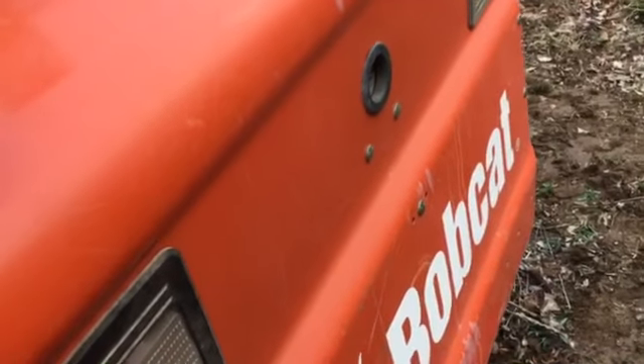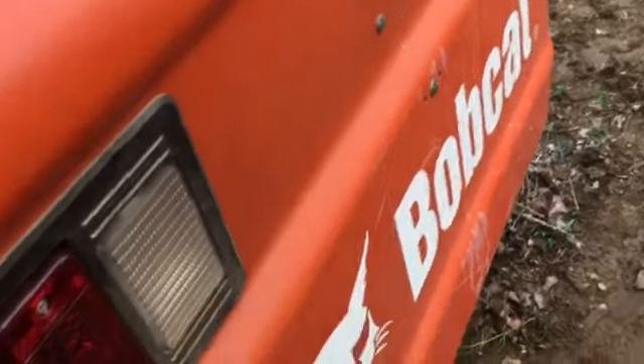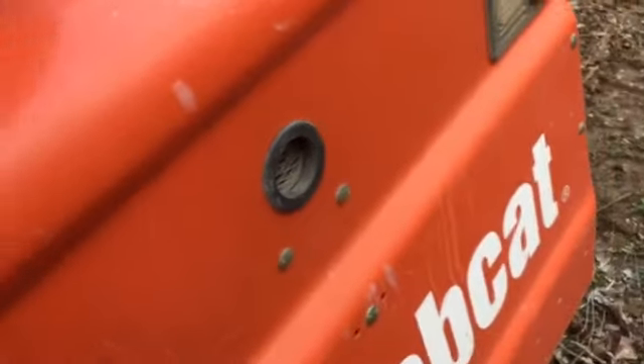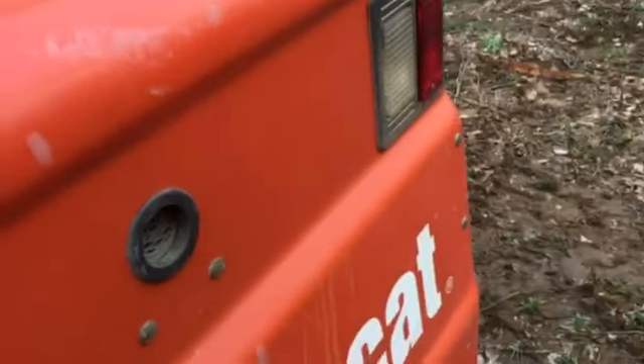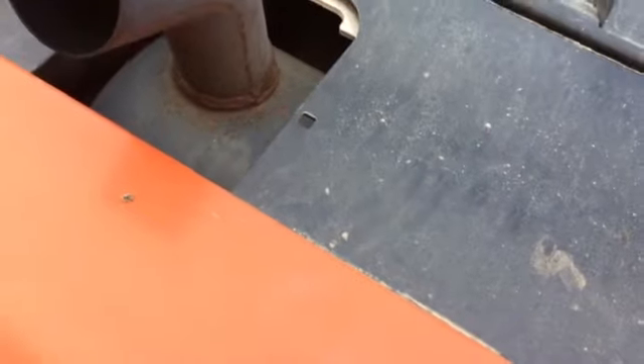Fuel filter and oil filter. The hydraulic filter you don't change all the time, but we'll probably have to here soon. Of course, I always grease the machine before it goes on a big job, or when it starts squeaking. You need to get it greased because all that dirt and stuff gets down to the pins and just wears the hell out of the pins. Mr. Let's Dig kind of told me that one, and I kind of knew it from the start. I pick up on things on YouTube.